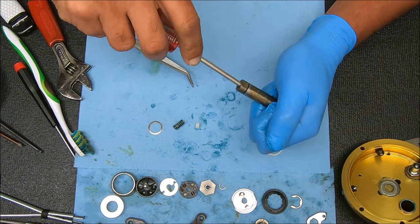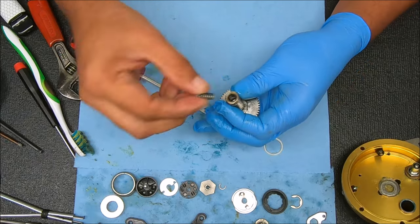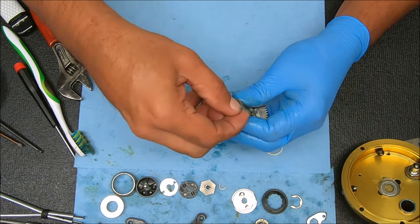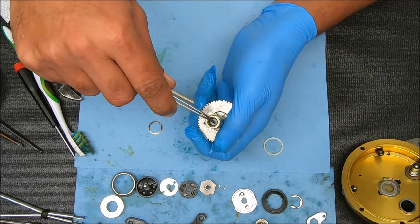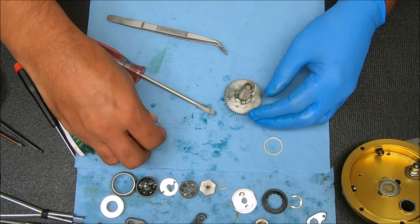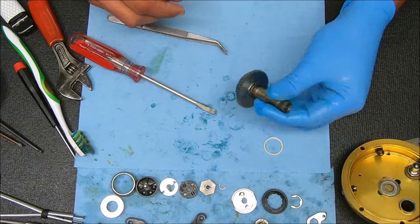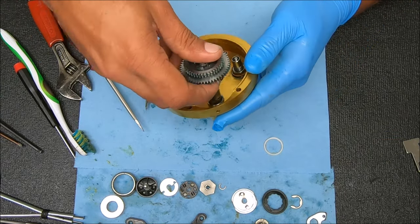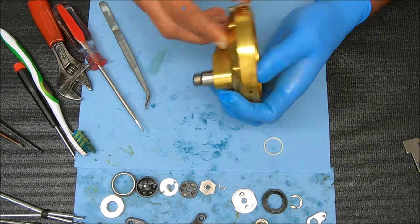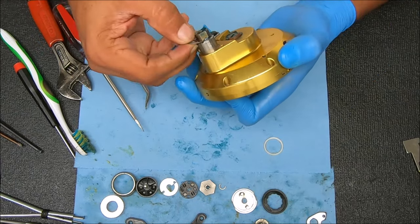Now I'm going to hold on to this. Snug it down. Drop this screw on top of it, put this button over it, make sure it's flat, and put this final piece on, which is the washer, and you're good to go. Now we're going to take that gear, drop it in, see how that feels. Yeah, that feels good. Lock it up with the E-clip.